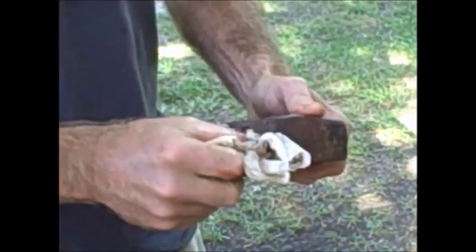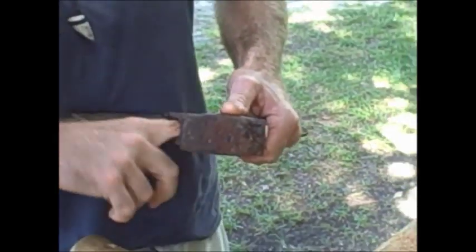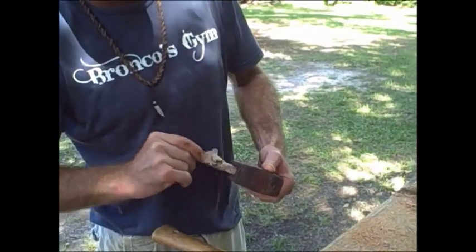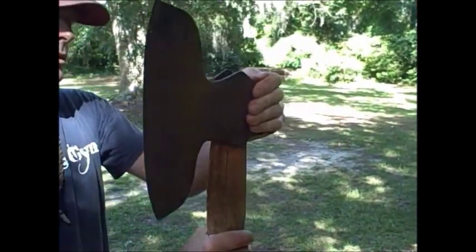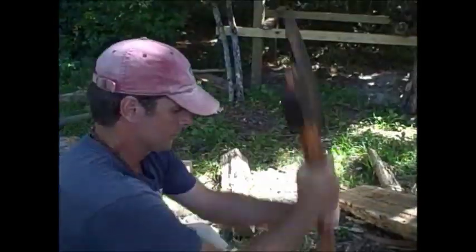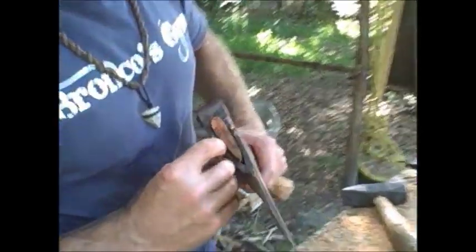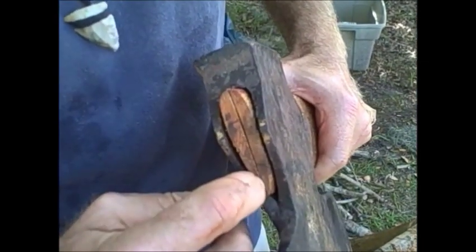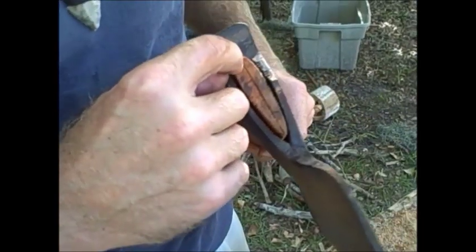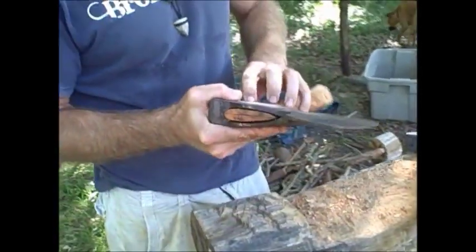I'm just cleaning it out to make it slide in a lot nicer. You see this gap — I've got all the way through, I've got a little gap but that's why I cut that slot. So I'm going to get my shim in position, hammer that in, and that'll spread out and hold it in there. This isn't coming out the way it is, but that'll just make it really nice and tight.